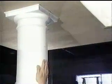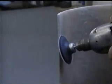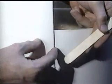Be sure that the 2 halves fit together properly before attempting any permanent installation. Although the columns are pre-matched at the factory, they may need some adjustment for a perfect fit. On occasion, there may be too much or not enough material in the joint area to make the seam fit properly. Too much material will require the removal of any excess with a sanding disc. Too little material will require small wooden shims. Shims can be cut from regular paint sticks. Now you have a perfect fit.